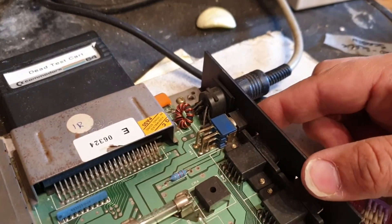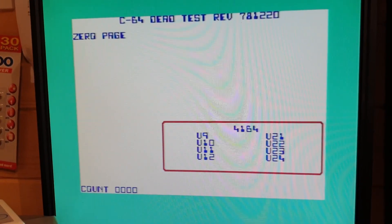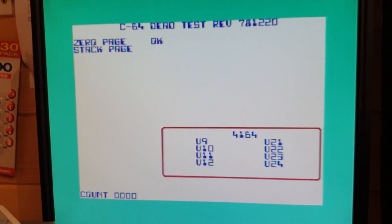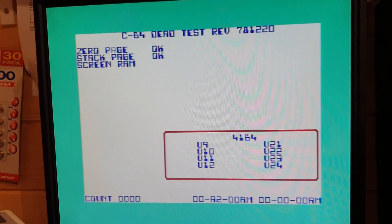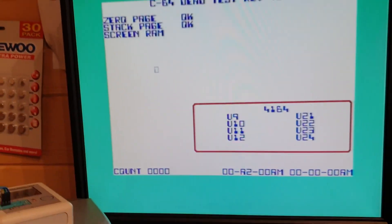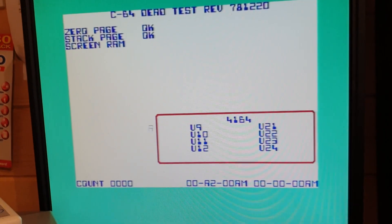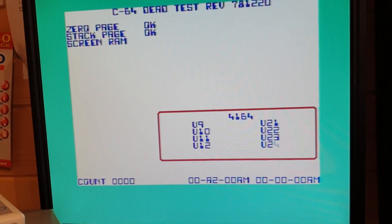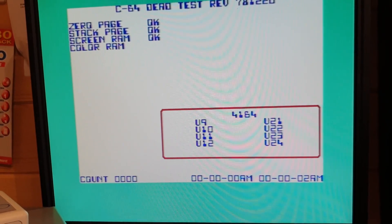So I'm going to power it up. We've got no flashes, and here's the black screen — and in a second, there we go. The zero page is tested within the CPU itself; that's testing the RAM that's on the CPU. And there you can see it testing the screen RAM. What will fail is — you can see down here — the time of day isn't making any sense at all, because that comes off the CIAs and we obviously haven't got those plugged in. It should pop back with the screen RAM okay. So that's the colour RAM as well.